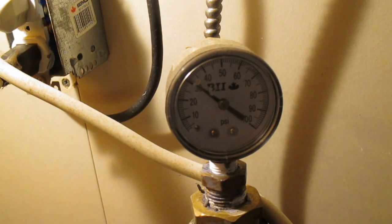And there we go — this was approximately 20 psi. Our switch operated power to the pump and it's now filling our holding tank with water, and shut off at 40. That confirms the system is back to its original settings.